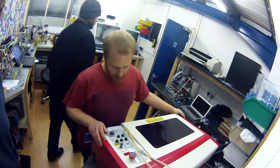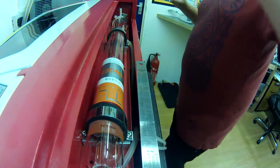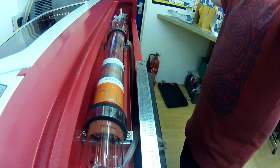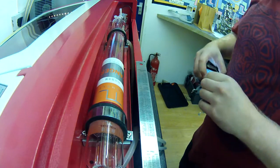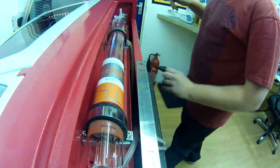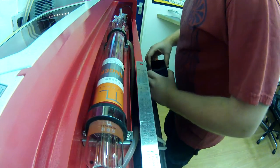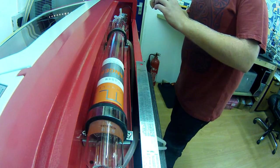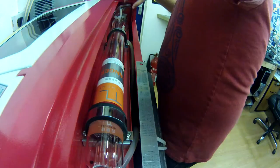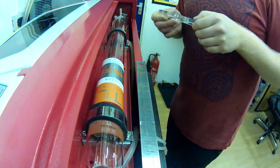All we need now is cooling. We've changed the tube in our laser. I'm going to turn the power right down and turn the laser on. What I want to do is adjust the position of the tube in order to get the beam onto the optic that reflects the laser light onto the little moving carriage with the lens assembly on it. I'm going to use an infrared-sensitive camera, since this laser generates infrared light, to try and find that spot. But it seems like this laser is working very well.